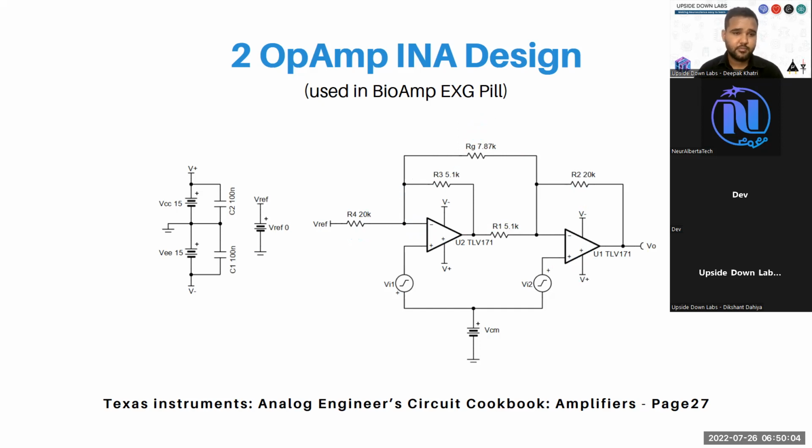So this is a very simplistic design of an instrumentation amplifier, and if you are trying to create something from discrete components, and you don't have laser precision for setting up the resistor values, this is the best option in our use case, because you have very little chance of using mismatched components and degrading your CMRR. So basically, you use all the components with 1% or better accuracy. If the components are not matched, your common mode rejection ratio will degrade a lot, and you will see a very noisy output, and most of the time you will see just the noise. Even if the signal is there, you will see just the noise in scenarios where an AC appliance is very close to it.